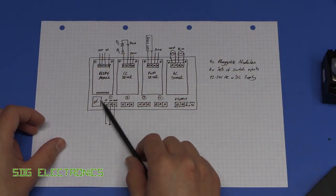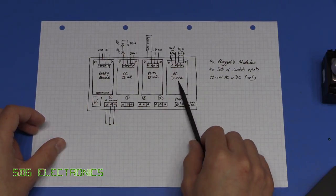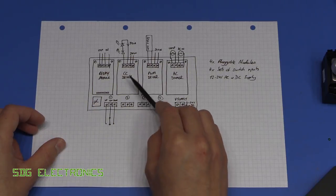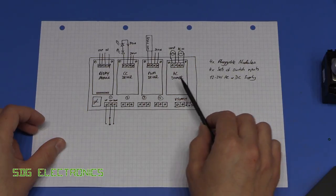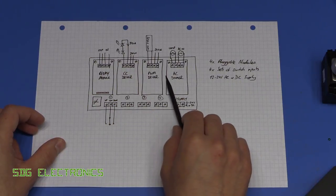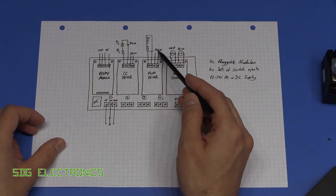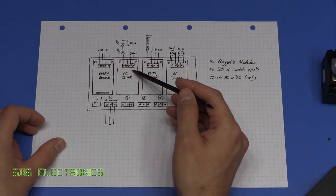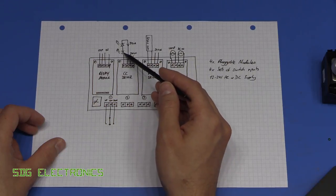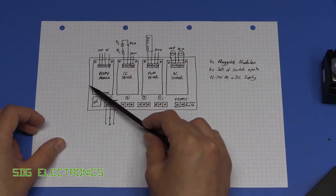The concept is a main board with a microcontroller controlling everything, with switch inputs at the bottom and four plug-in module slots. These will be individual PCBs with a standard format, pins at one end and screws at the other, so you could have four dimmers, four relay modules, or any mix. One module type accepts mains in and drives standard mains lamps; a PWM driver takes DC in and drives LED strips; a constant current driver controls LEDs at say 350 milliamps for standard 1W LEDs; and a relay module for switching things like a bathroom fan.